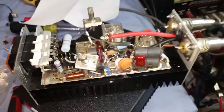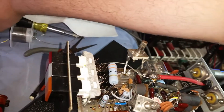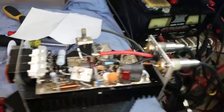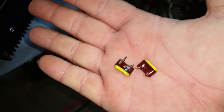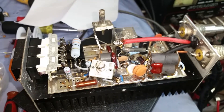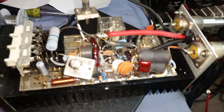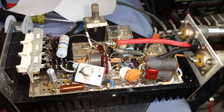Some of the problems were cold solder joints. Due to it being very hot at one point, there was a cold solder joint on one of the 765 picofarad silver dip micas on the output transformer. The first thing I did, of course, was the transistor was blown — this right here. I went ahead and put another 2290 in there, and all I could get was about 50 peak out of it. That's when I had to go ahead and start going down the rabbit hole.